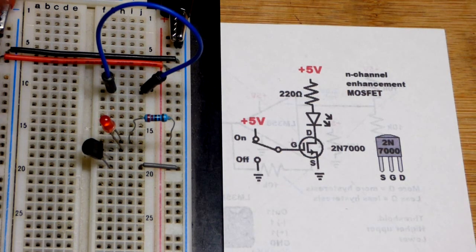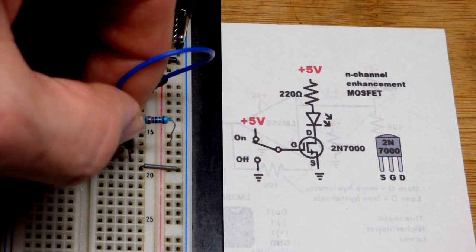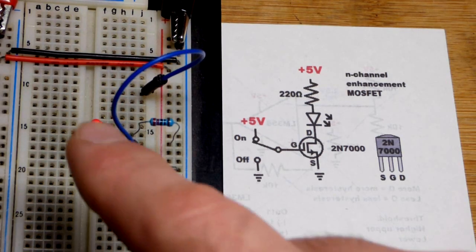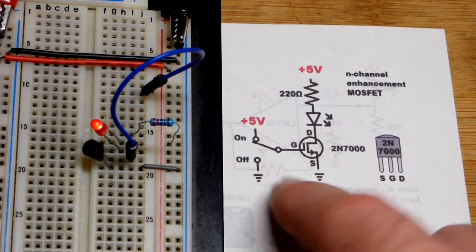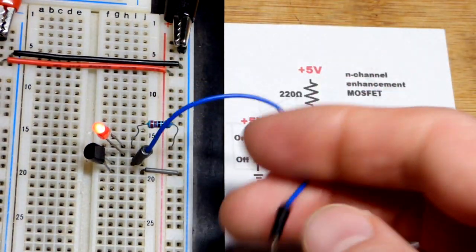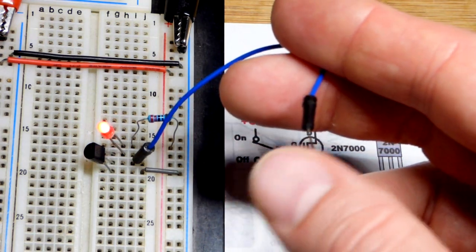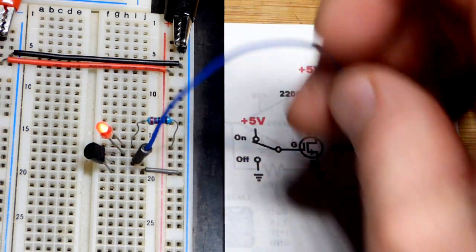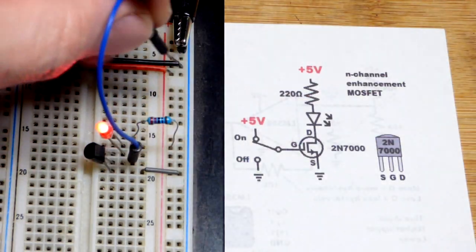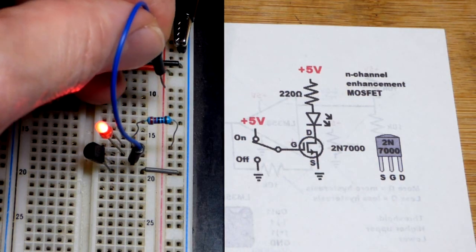So we are going to give it a voltage first. We'll end up giving it stray voltages. This is a good demonstration. You can see we got a little glow there. This is kind of like a capacitor, it builds up or releases a charge for the most part. And so we can give it false signals when I let go. Maybe it'll be more positive, maybe more negative, maybe more on, more off, whatever. So it can store charge for a while. It doesn't depend on current to be on, like the bipolar junction transistor.